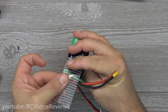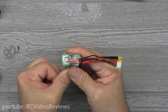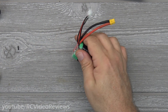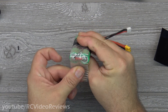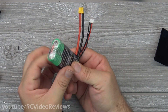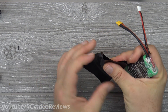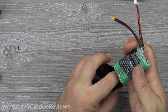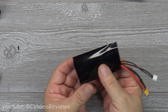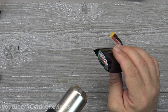Since I plan on shrink wrapping this battery pack, I'm going to put some tape over these cells to provide a little bit of protection and strain relief. I'll line my cables up, pull that tape down nice and tight — this is a scotch fiber tape or packing tape — just to provide some strain relief on the wires. Same thing on the bottom, just to give a little extra support to that mechanical linkage. Then finally, the shrink tube. It's not easy to find, but to do two 18650 batteries you use 60 millimeter flat shrink tube. Just a little overlap to cover the ends. Go nice and slow with the heat — do not get the batteries hot. That's the last thing you need after all this work.